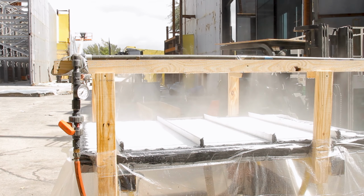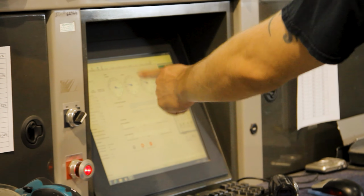All right, so the version 3 updates. The main differences between this one and the last version basically came down to we added a bunch of testing. We did additional testing on our systems. We got Florida high velocity hurricane zone approvals, so that required us to test corner zones and also do wind driven rain testing. A lot of the changes were mainly driven around the engineering that we offer on the panels. But by getting that engineering, that made us have to change basically all the supporting documents that go with it. Cut sheets had to get changed, guide specs had to get changed. Anything that had that engineering listed also got changed so it could reflect the new information. That's the biggest part that changed.